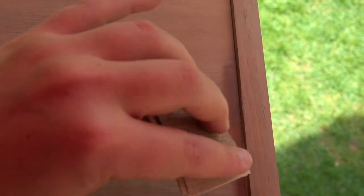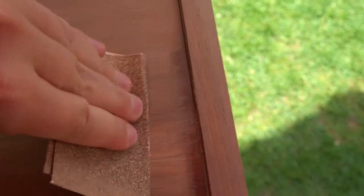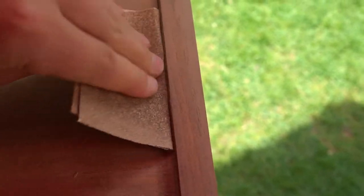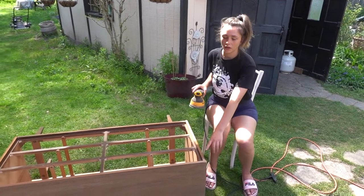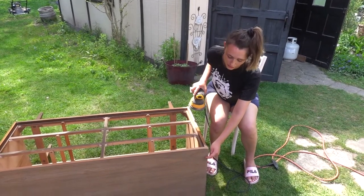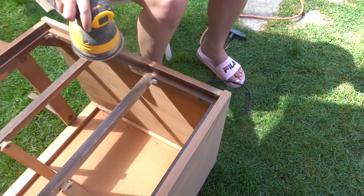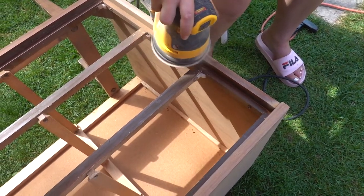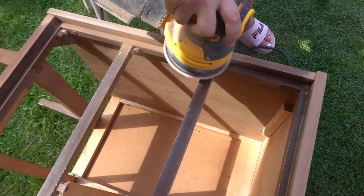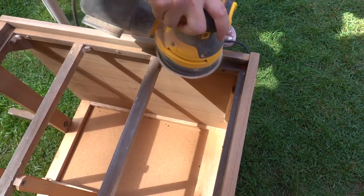This part is really tedious but eventually you get it done. I'm just sanding this part because it's attached here and I want it all to be the same color. You have to be very careful when sanding these pieces because the veneer is very thin — as you can see later on I did go through the veneer here, so just be very mindful. Also I wasn't wearing a mask in these clips — I hadn't been doing this very long, so now I do. Please make sure you wear a mask to protect your lungs from all the sanding dust and the old finishes on these vintage pieces.